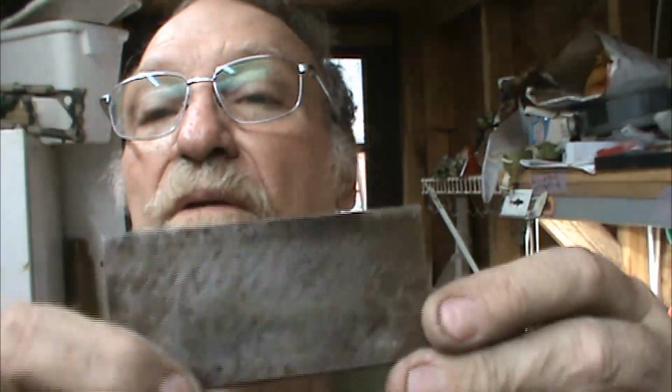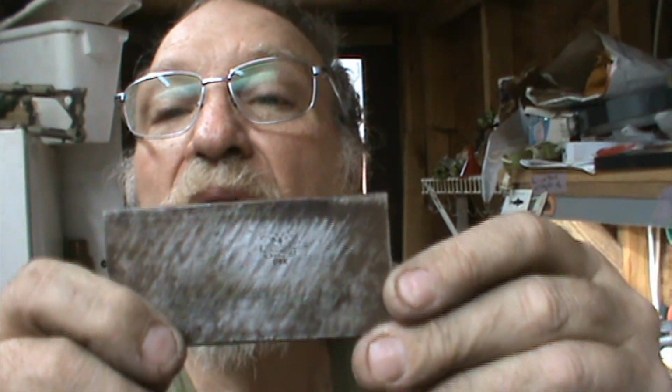Like I said, I just started this. I've been doing odds and ends. I built myself a metal etcher, like a personalizer. It'll do AC and DC both, and I've played with it a little bit on a piece of metal. Then I sanded it. I didn't sand this down too good to start with. What happens is you start out with DC, or you put it on AC, you mark it, and you see where it's at and make sure that it's where you want it, because you can just about wipe it off if you only do it for a few seconds on AC. It'll turn it black right there where the stencil is, and you can make sure you ain't got it crooked and all this other stuff.